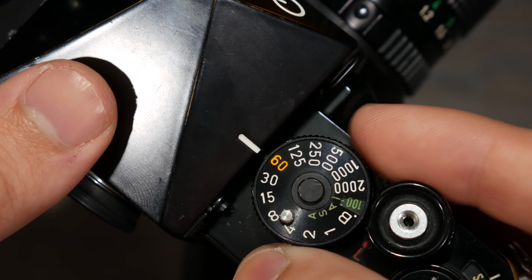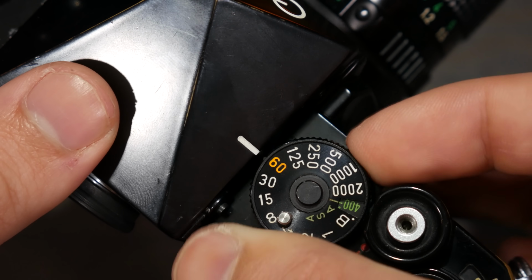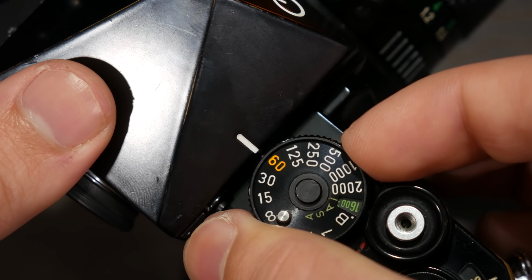The needle will indicate the same apertures for a doubled film speed as it would for a halved shutter speed. So, if you can shift those sensitivities around, you can adjust the meter for different film speeds. That's exactly what changing the film speed setting does. In fact, that's literally what it does because we're dealing with a mechanical contraption. Adjusting the film speed essentially relocates the different sensitivities of the light meter independently of the camera's shutter mechanism.